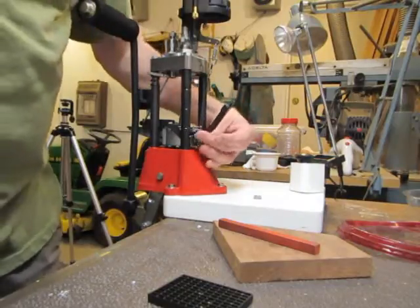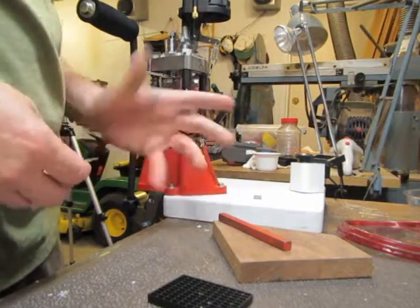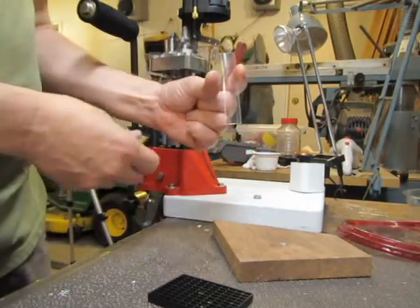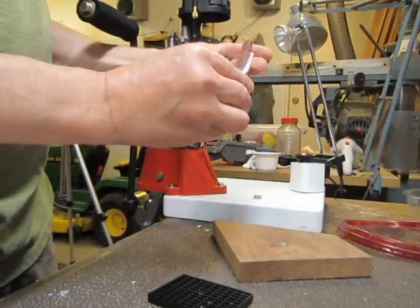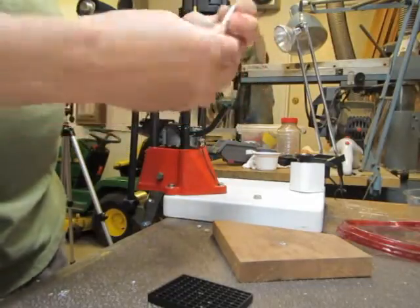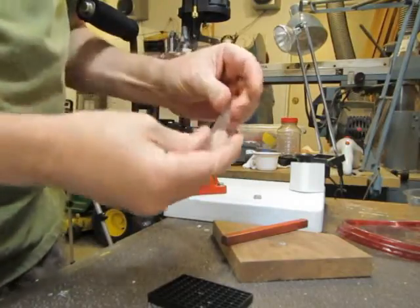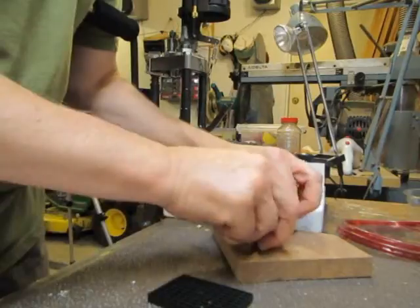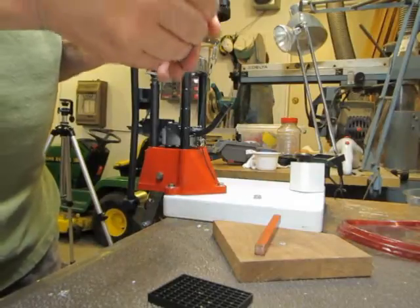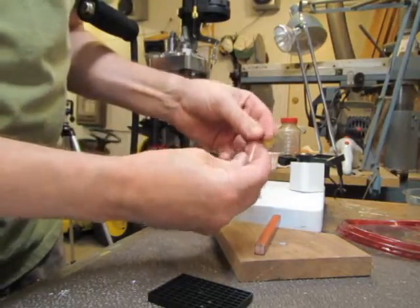If you look at the primer trough here, it's 3/8 of an inch wide. I happen to have a piece of metal here that's 3/8 of an inch wide. You could use a piece of wood, it doesn't matter. I cut a piece that's 3/4 by approximately 3 inches long, and I'm going to bend it over this metal piece. All you're trying to do right now is just scar the plastic. Obviously, if you heat it up a little bit, it'd make it easier for you. But all you want to do is get a couple of crease lines going in it. So here's the first crease line that I have in it. And I'm going to get this second crease line going now. So you can see I scored the plastic a little bit there and scarred it.